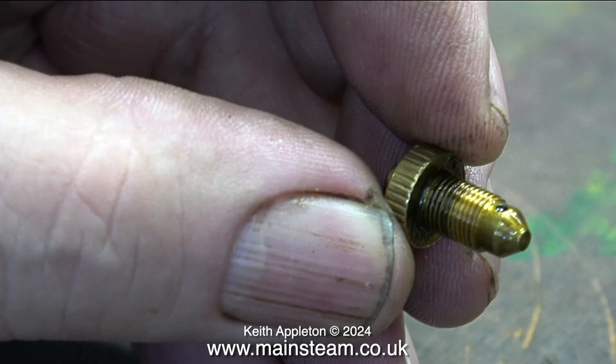The part I've just removed is actually a valve — you don't take it out all the way. When the lubricator is in service, you just open this valve, which first of all clears the water, and when you see oil running out of it, you close the valve. Then before replacing the lid, you top it up with steam oil, which is very thick and gloopy stuff.